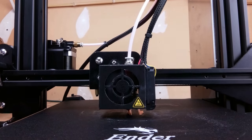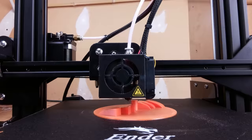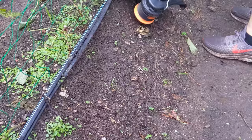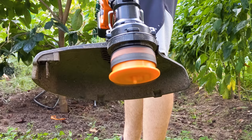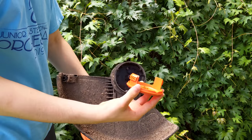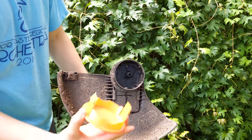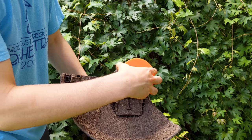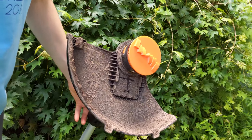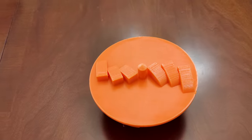In an attempt to create such a tool, I 3D printed an attachment to a string trimmer that allows it to obliterate weeds, which is why I call this tool the obliterator. The attachment takes the place of the spool cap, utilizing a similar design to snap securely into place. It employs a few well-supported teeth to eat away at weeds when spun quickly, and one centered spike for stability.